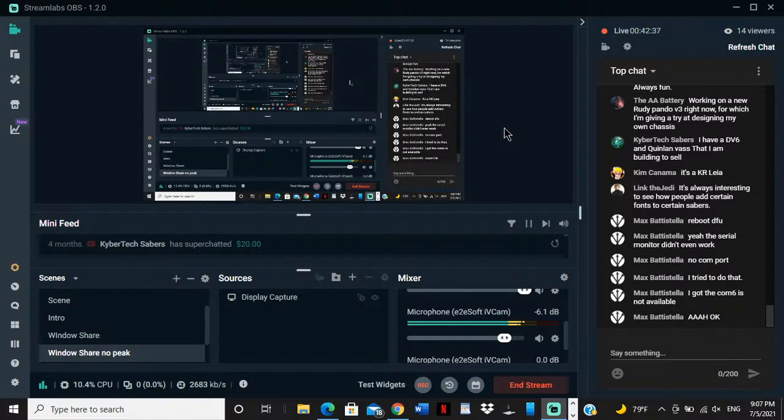But then once you program it, it will recognize it as a Proffie board again. When it's in bootloader mode, your computer does not recognize it as a USB device Proffie board. It recognizes it as a bootloader mode something that needs to be programmed. So you just hit upload and it will program.